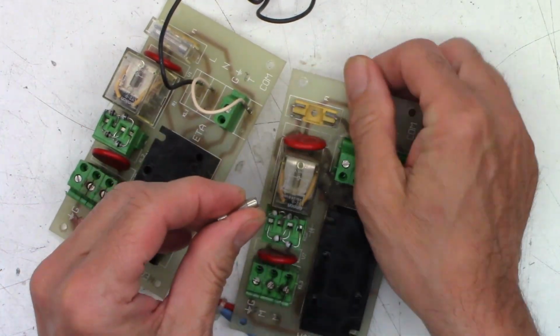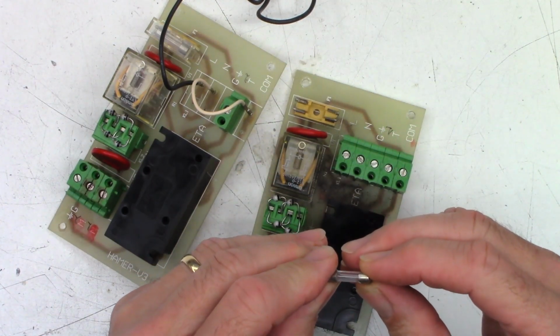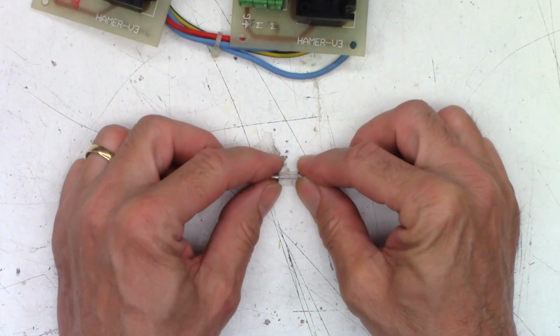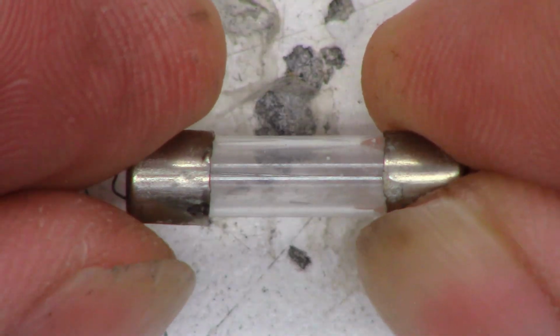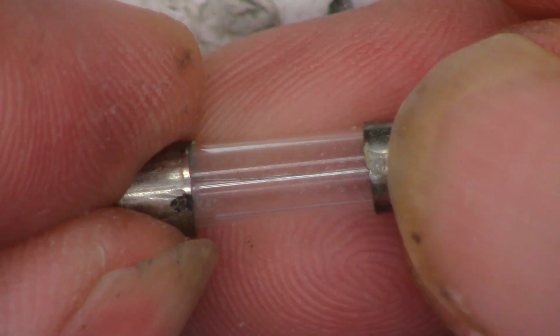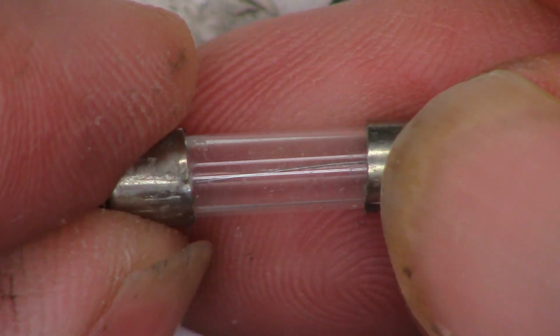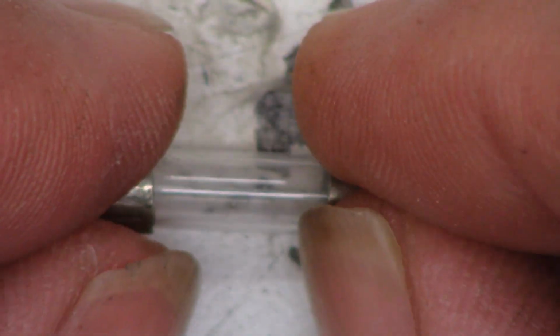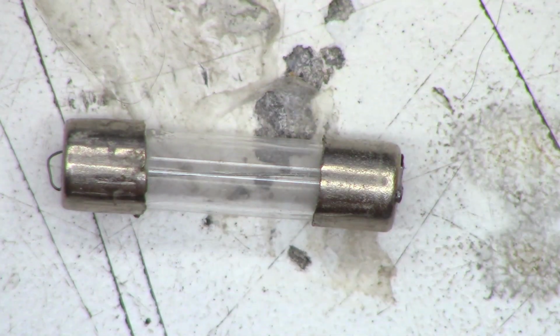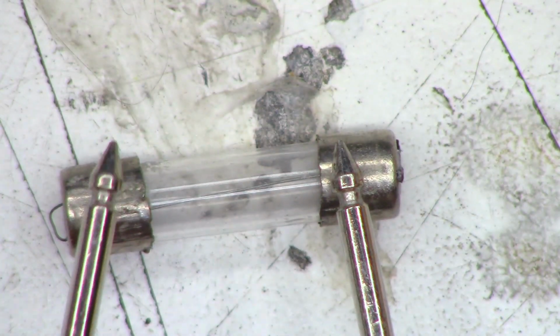And I don't think it's a pin fitment issue. Try to wipe it off a little bit. The fuse actually looks okay. Let me go ahead and get a zoomed in view. One moment. Okay, so there is the close-up view of the fuse. And if I put my finger behind it there, the element looks perfectly fine in here. It does not look like it is actually blown. Keeping the meter on continuity, you can hear the beep right there. And it tests good now.